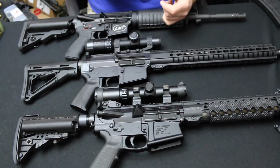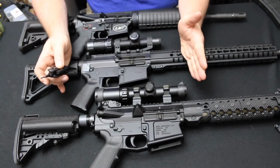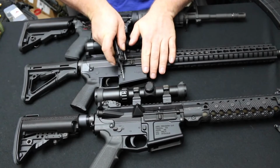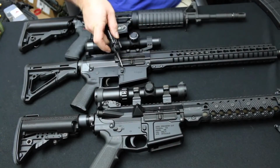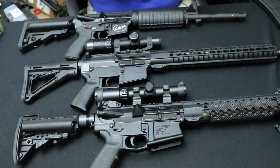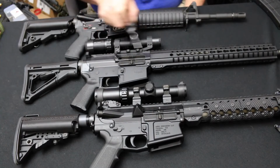And we're going to show you the comparison between the bolt carriers as well. But for the 7.62x39, this was ideal. You had much more room in the area of the magazine well to make a proper mechanism to take an AK-47 type magazine. And more importantly, the bolt carrier used a scaled down AR-10 or .308 bolt instead of scaling up and making a thinner, less durable AR-15 type 7.62x39 bolt carrier. So as you can see, the Mutant right here, well, this is the Anvil.